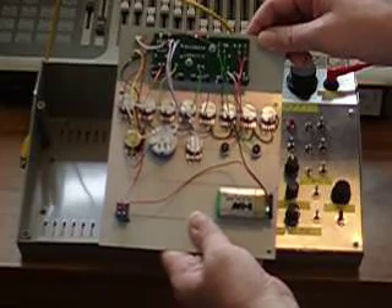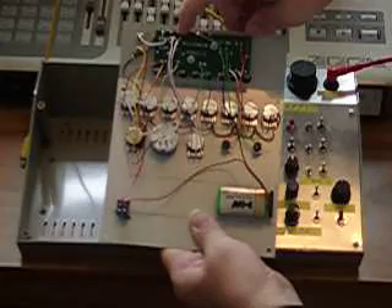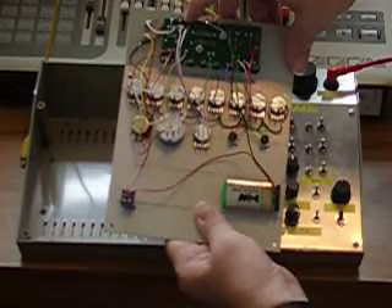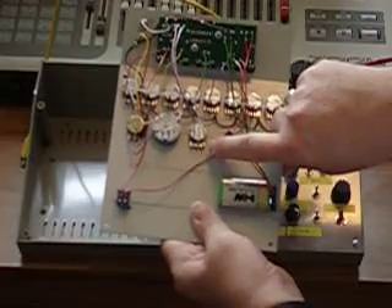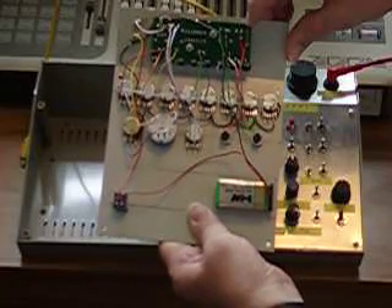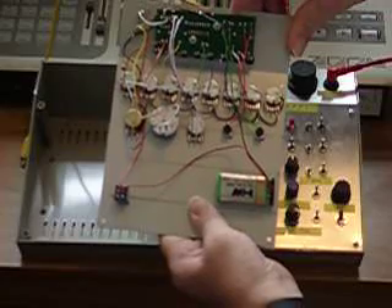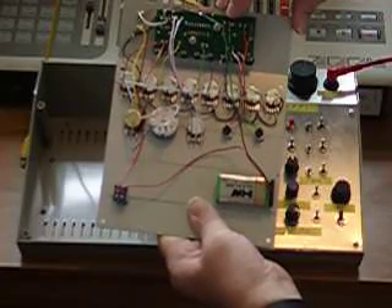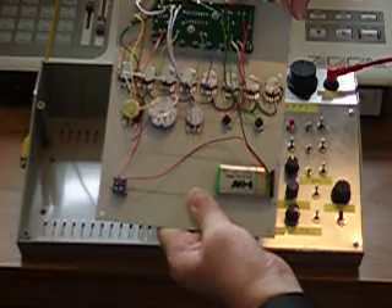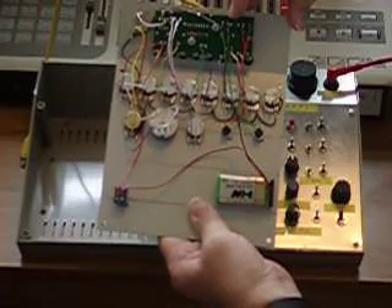There are three controls on the board which need to be taken out to the front panel. The first is the rate potentiometer, which sets the speed of how fast things operate. On the original circuit this is 2.2 megaohms, which is a bit extreme for our needs, so I've replaced it with a 1-megaohm linear potentiometer, which is perfectly adequate. We also need to replace the two pushbuttons on the board with simple pushbuttons for programming and resetting. Note that the pushbuttons included with the kit are four-pin types — those connections need to be soldered in manually in their place for the circuit to work properly.